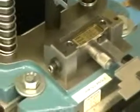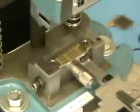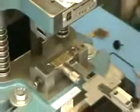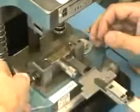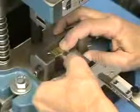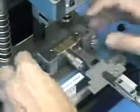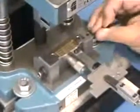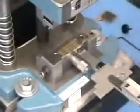It is very easy to set the standoff height by unlocking the mandrel that holds the nest, then adjusting the micrometer to the desired height and then relocking. Micrometers are available in inch or metric dimensions and a digital version is also available.